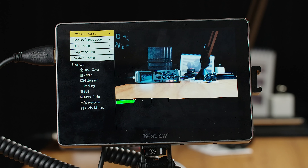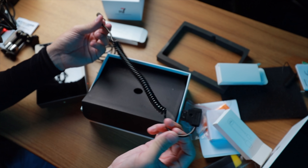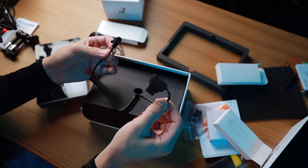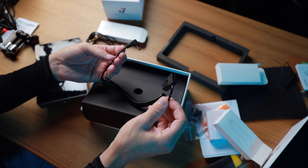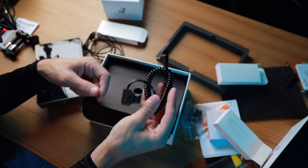Although it is very bright at 1000 nits and easy to see outdoors, the monitor doesn't really get hot — it may get warm, but even at the highest brightness for a long time it doesn't get hot. There are no fans, so you don't have to worry about that if you're using it with a mic close by. I also love that they include a D-tap cable to power this when you have it on a rig with a V-mount battery, for example — a great way to get longer battery life without a large bulky battery, and that's not usually included with most monitors.